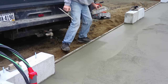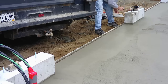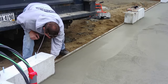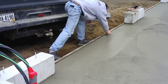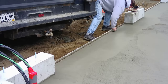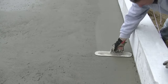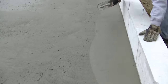To finish off those garage doors, you hand trowel them to get them nice and smooth — you don't want to just leave them the way they are. Each pass we go over with the power trowel, we then hand trowel the doors. Depending on how firm the concrete is, we'll either broom it right away, like I'm doing now, or we'll wait, hand trowel it again, and then broom it after. This one was setting up pretty fast, so we gave it a nice smooth broom finish on that tapered part. The front of the door gets a nice edge — we usually leave the edger mark because it looks a little more professional and clean.